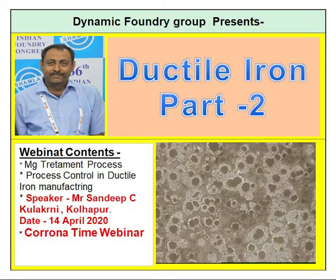Ladle design, I will say it is a common factor, so I will not go into detail because normally we use the same ladle. As I told you, the ladle design, the diameter to height ratio should be 1:3. So if diameter is 1, then your height should be 3. It is somewhere between 1:2 and 1:3, but that is a constant factor, so I'm not going into detail on that.